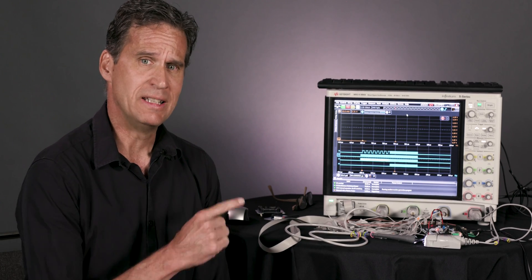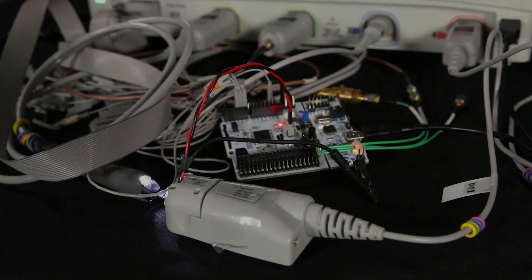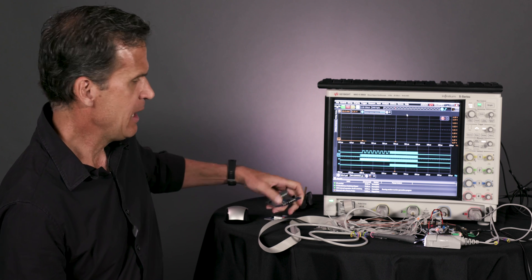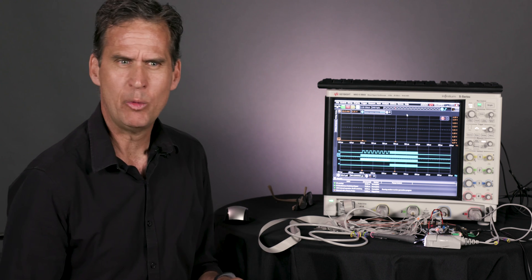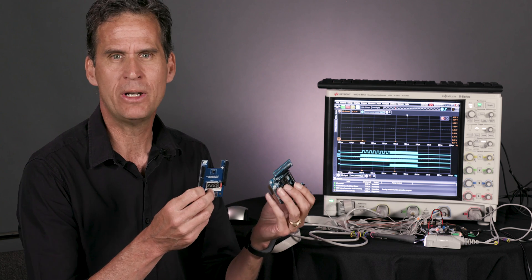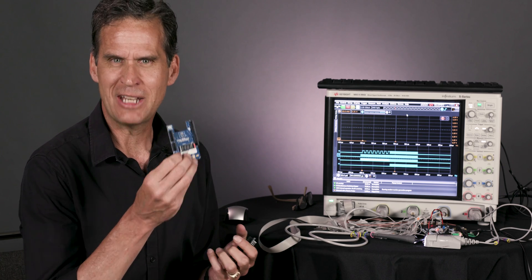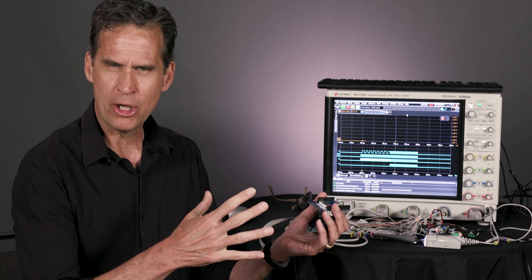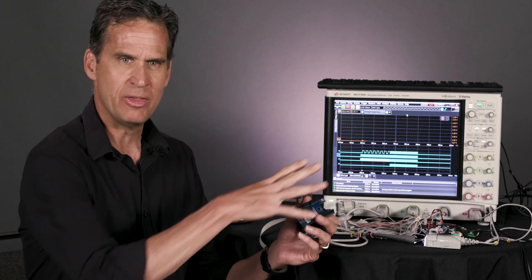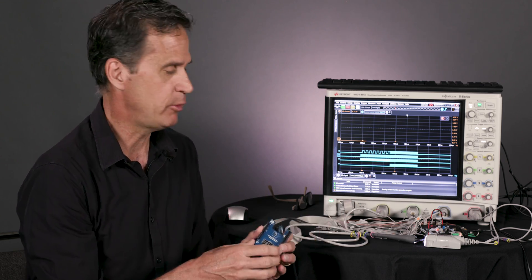What I've got today is this little board here. It's kind of an IoT development board, and these are pretty common. The way they're set up is it's a base board that you can program really easily, and then there are these other things they call shields that you can plug in. So if I wanted to breadboard my IoT device — like this is a proximity sensor that does time of flight — I could plug that in, build up my code, make sure the app is working, and then shrink it down into my final form factor.